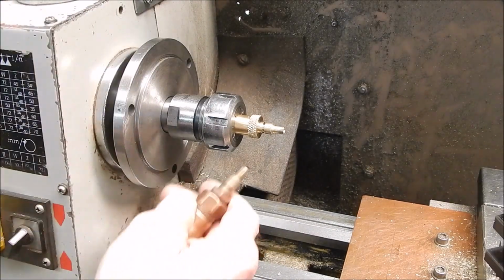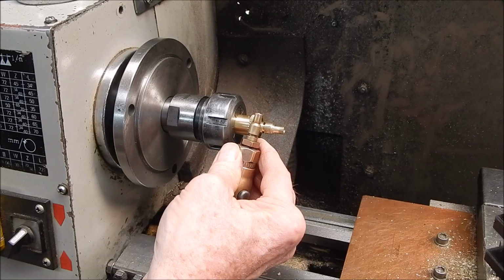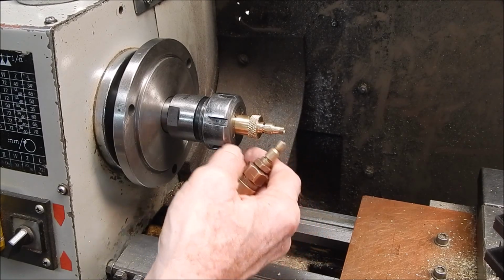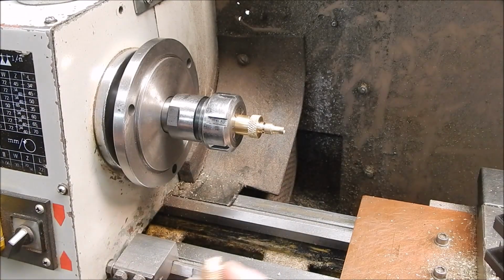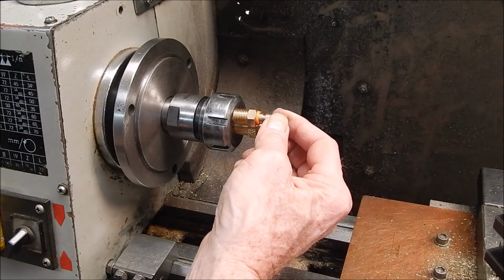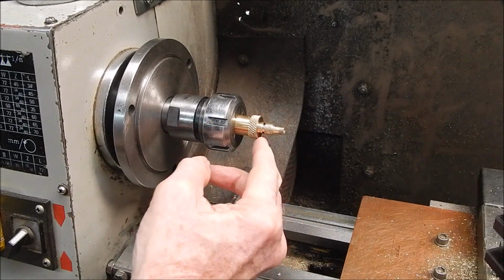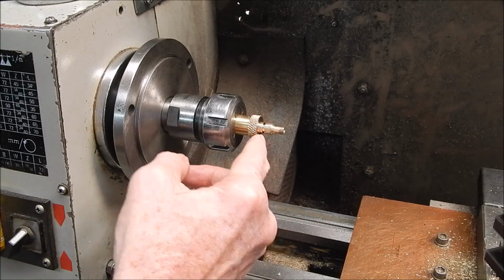I made it a bit different. I can't do a hex for a screw-on setup very easily, and you don't need it with a hose anyway, so I just knurled it, and that'll give me something extra to grip. It's a little bit different to this, but it's not any bulkier really. When I pull the connectors apart, I can just grip on that, and I'll break those edges after I've done the job, on the linisher.